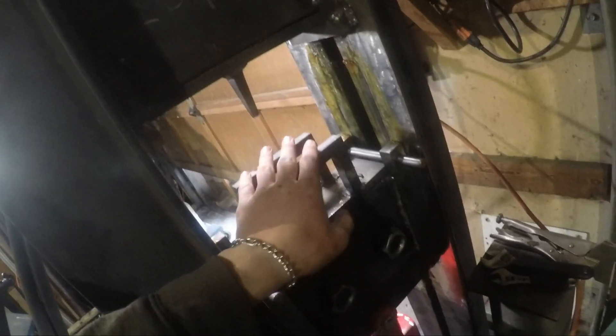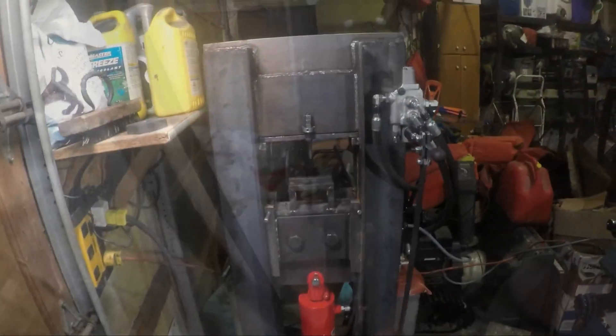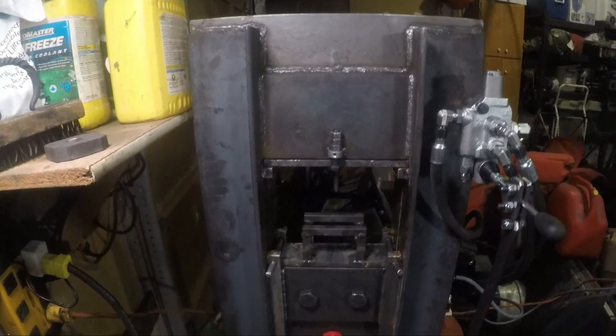If we go around the back here, this is to protect the hydraulic hoses. Where my hand is, there are two hoses that go down to the cylinder, and the back of the tank is right there. So to protect the tank and the hoses, there's a little piece of stainless steel wedged in — so if any of the scale comes off, it'll hit this and get pushed to the other side away from it. So this is the overview of it.